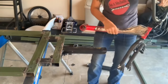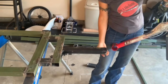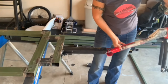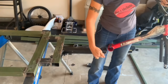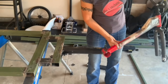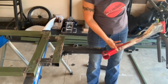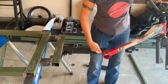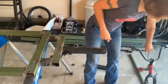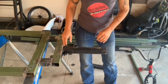to this bike frame. What I'm gonna do is sit it on the ground, put a block under it so I'll know exactly how high it is from the ground, and it's gonna be like this, but I have to cut this at a little angle that matches this. And so whatever the rake is, I will figure that out, and I'll put it here and trace along here, and then we will take it over to the bandsaw, cut that out, and then I'll weld this to the bike, weld this to the frame.